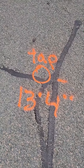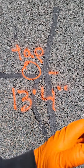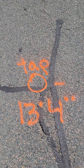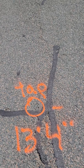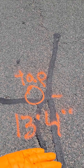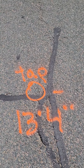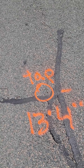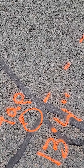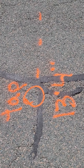All right, so we got this — this is our tap. There's really no issues with the tap, and there's at least a good 20 feet going back or so. We just wanted to get that on the record because it is much deeper, so whoever needs to do the repair can get a lower spot to tie on to, to ensure that there is proper fall for this line.